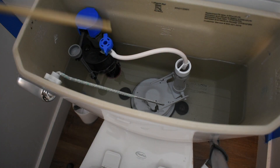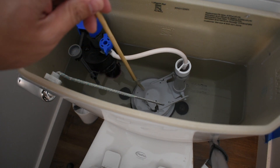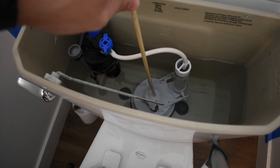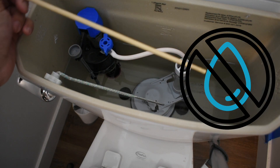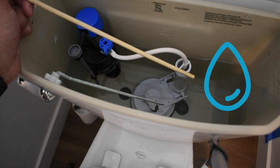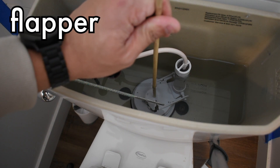A potential fix is to replace the flapper. I wanted to test this theory, so I grabbed a little stick and pushed on the flapper to see if I hear any more trickle. The reason I use a stick is it's small and doesn't displace too much water — putting your hand in there raises the water level, but the stick does very little. I put the dowel on there and push down — the water stops. I let off and hear some trickle. I test again, push down just a little bit, the water stops. That tells me the gasket around the flapper is faulty and has gone bad.